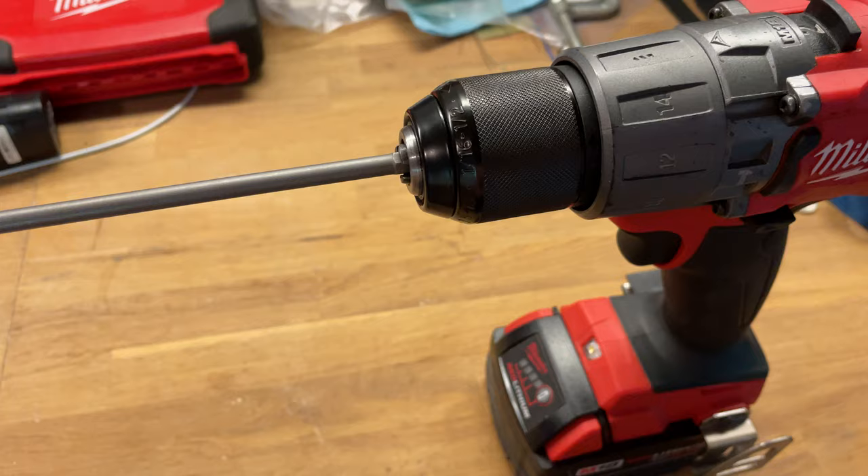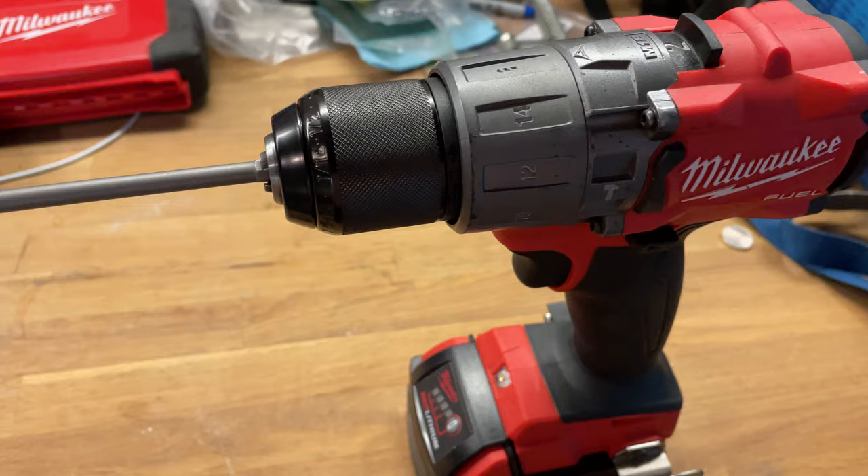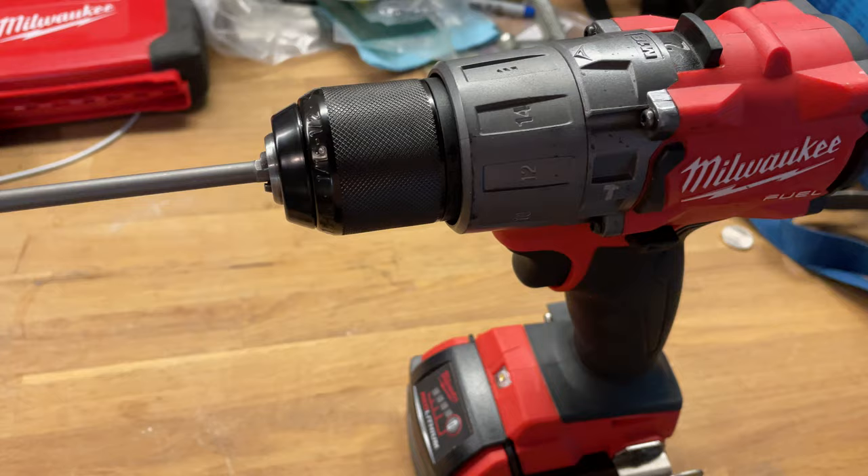That rotating plate was just a bonus feature — I was really just checking out the run-out. But this has become an excellent drill. I really wish Milwaukee could have got it right the first or second time, but I'm really happy I didn't have to abandon my investments in this and the rest of the system. So if anyone else is having run-out issues, check out Röhm — R-O-H-M. Great upgrade.